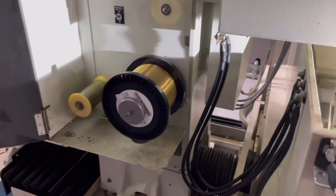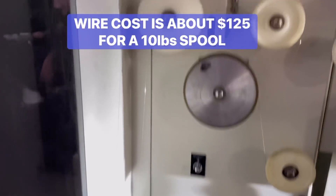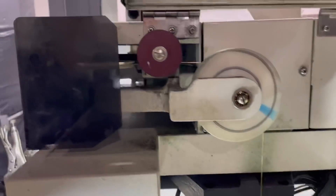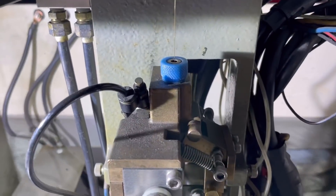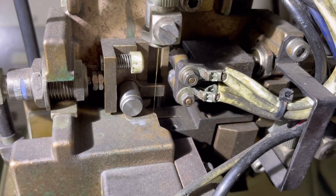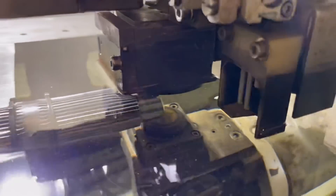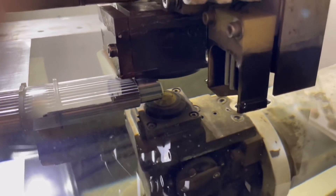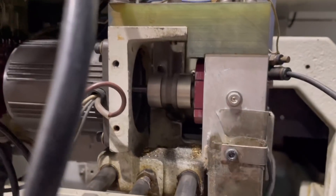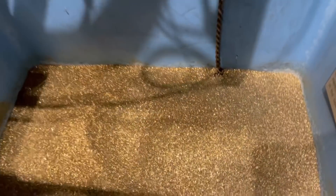The way this works: you have a spool of wire that goes to a number of pulleys which set the tension. It runs through, comes out the head, goes through another pulley, comes back around the front, and moves down through the head. It goes through diamond-coated guides, comes down through here — this is where you can automatically cut the wire and re-thread it, like if you're inserting it in a hole. It comes out the bottom to the lower head. From there it comes out in this area — this is actually a chopper that takes the used wire and chops it up into fine pieces.